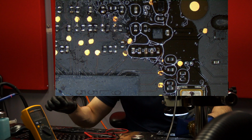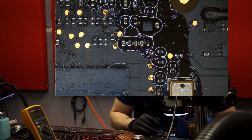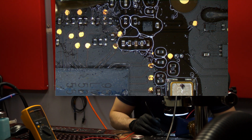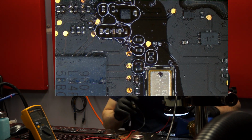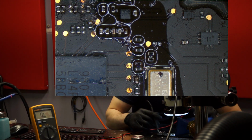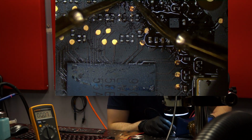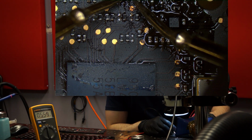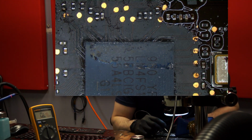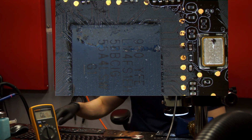is in the middle up here. Piece of shit. Okay, there's 3.42 volts there, and I'm pretty sure when I measure it, I'm going to see the 100 kilo ohms that this schematic is telling me I'm supposed to be getting here. Close enough. Fucking piece of shit. Okay, so that means the SMC is bad. Well, boo.